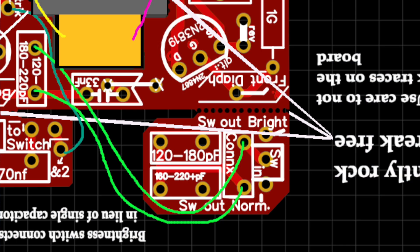The brilliant thing about this project is that you can add your own EQ contour to the low-end and the high-end — this green capacitor is the low-end, and the blue one is the high-end. What Duffy did is create a daughter board that solders into the spot where the blue capacitor is, giving you the ability to add not just one capacitor but two, and switch between them. So you could have 220 picofarads here and maybe 150 with the second one, and be able to switch between them.